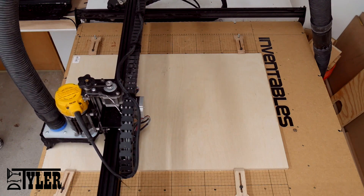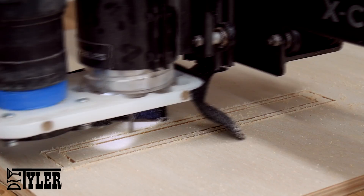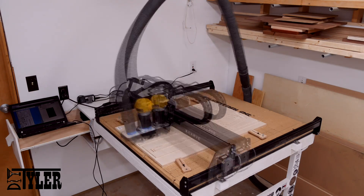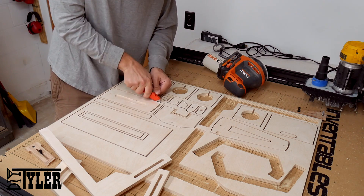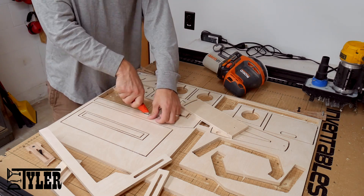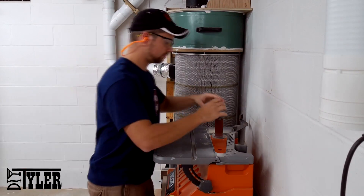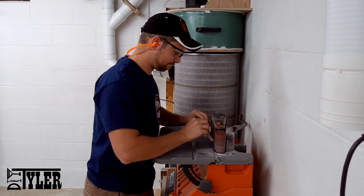Now I have a CNC so this is a perfect opportunity to use it. It did bite me a little because all of the inside cuts on this particular build were a little bit small, so I spent a lot of time filing and sanding the inside cuts to the dimensions I needed. I had the CNC leave tabs between all the parts to hold them in place, and before I broke those tabs loose I sanded a bit to get any frayed plywood veneer, then cut all the parts out and sanded all the inside and outside edges smooth on my oscillating spindle sander.